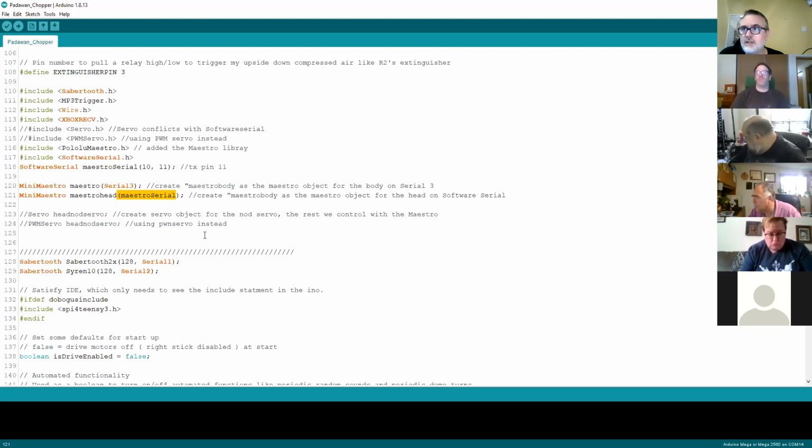And secondly, what I'm really conscious of is keeping the closest, fastest control that I can do on the motors for a 200-pound droid, or whatever these can be when they start to be made out of metal rolling around. What I don't want to do is have anything that interferes with the foot drives. Things like animations and even the dome spinning, I'm not as concerned about, but I would tend to try and keep the foot drives at least on the standard serial.